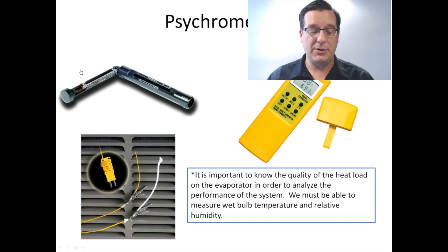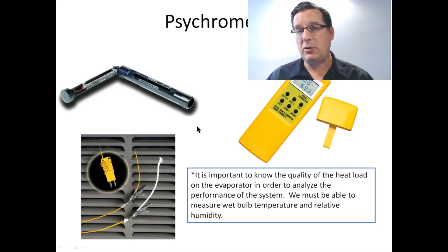You get two different temperatures: your dry bulb temperature and your wet bulb temperature. There's also a related product that Field Piece used to offer — two temperature probes with little clips so you could fasten them onto an air grill. One probe has a little cotton sock you get wet. The psychrometer measures wet bulb and dry bulb temperature, and when you combine those two temperatures in a specific formula it tells you all kinds of important things about the properties of that air.